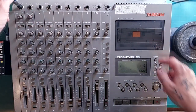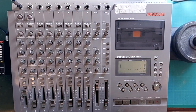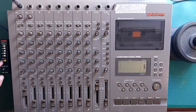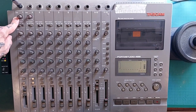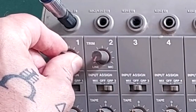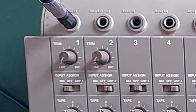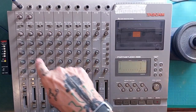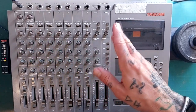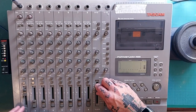Because this is outputting at minus 10 dB, that's line level, so it should be a pure sinusoidal tone. As I turn it up, you can hear more overtones and more harmonics, because when it's saturated, the top of that sine wave is getting sawn off and it's becoming a square wave. A square wave has more harmonics, so it acts a bit like a fuzz pedal. Let's turn that back to a normal level so we can hear the pure tone.